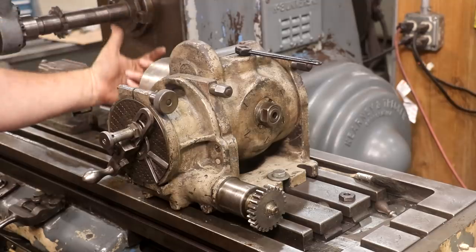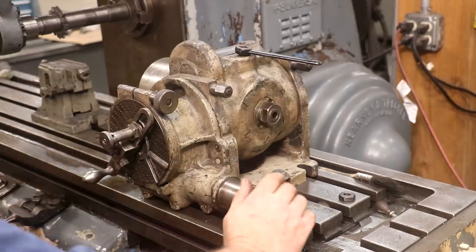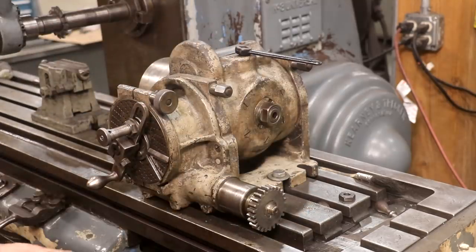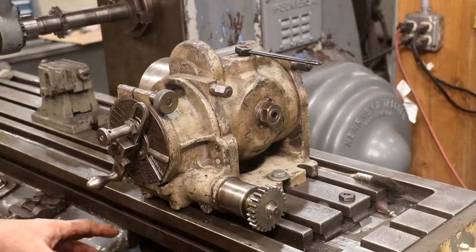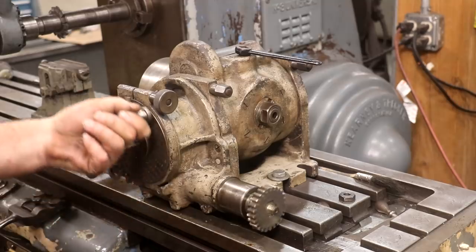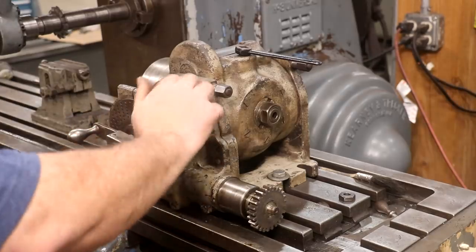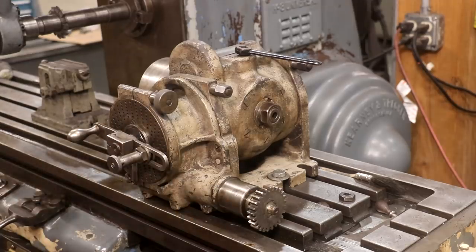And that's what gives you that spiral gear being cut. When you back out, there's hardly any backlash in this at all — you end up right back where you were. You index to your next point, then go back in and cut that tooth, and that's going to slowly twist the chuck — that's what gives you that spiral gear. We got it freed up. Everything is like it should be now, and I'm really excited about that. It has never worked since I got this dividing head, but a good cleaning and going through it did the trick. I can turn it by hand up here, and when you're not cutting leads you just lock it in place right there.